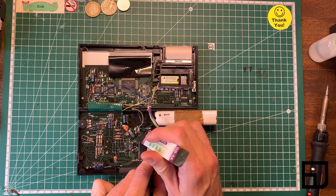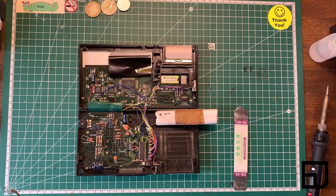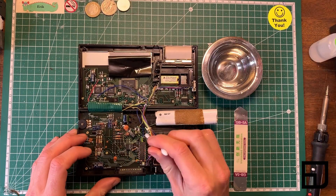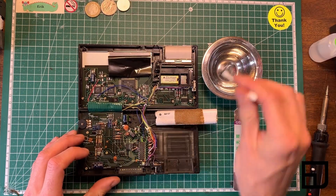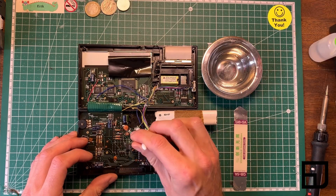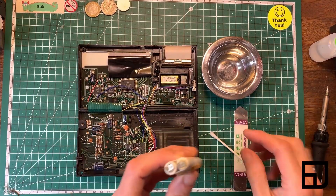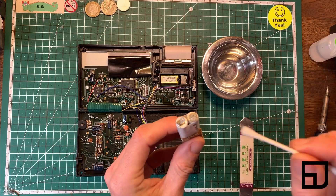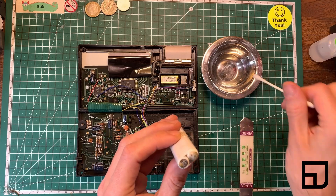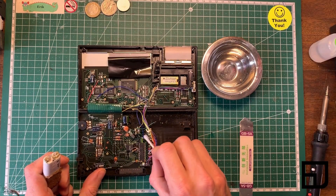We need to rebuild that and replace this wire — that trace is on its way out. I'm going to grab some vinegar and some Q-tips, just put it on there and let that soak in to neutralize the electrolyte from the battery. If we put vinegar on here, see how it fizzes up — the acidity of the vinegar is neutralizing the alkaline base of the battery, which is corrosive to the circuit. I'm just going to let the circuit soak in that for a minute.